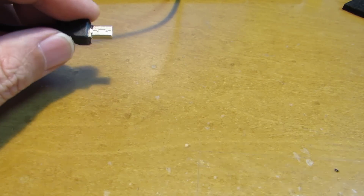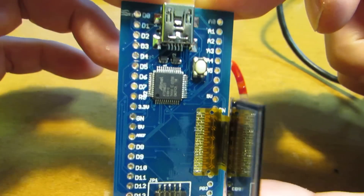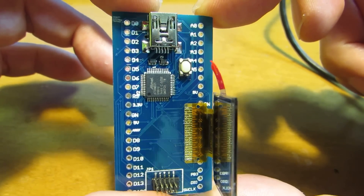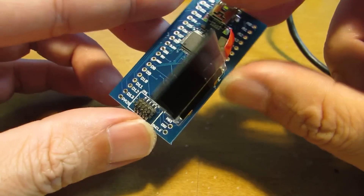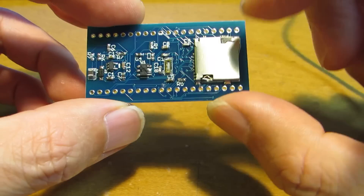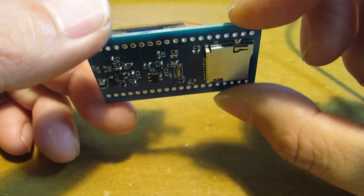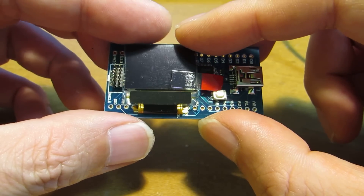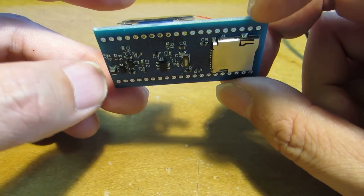And this time I made a bit more advanced one. This time I made the board with SAMD21G. It's ARM architecture, ARM Cortex M0 Plus. And also it has an OLED display on board. Same as the previous one, I prepared a microSD card, so you can record and apply some data from the microSD card. And the full color OLED display requires 12V, so I put the voltage converter from 3.3 to 12V.